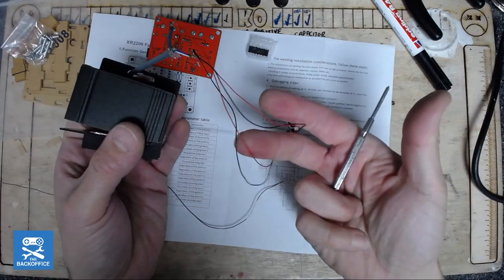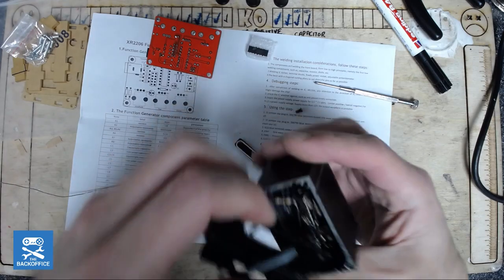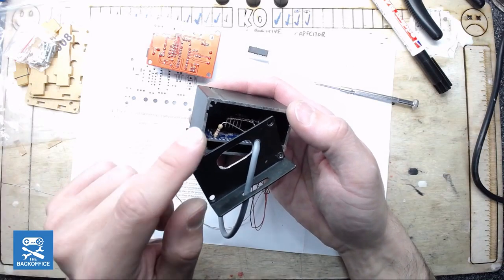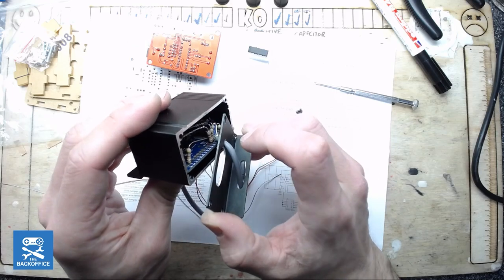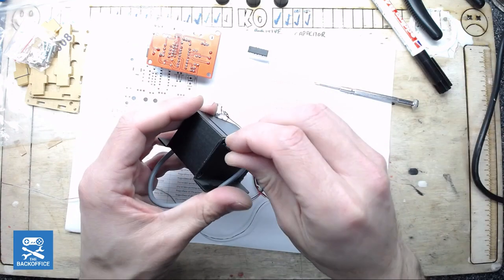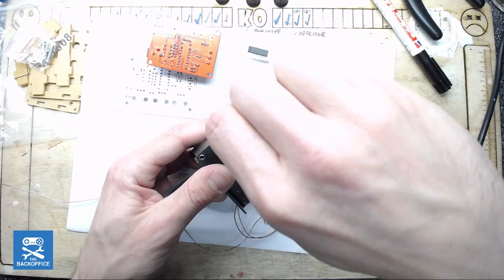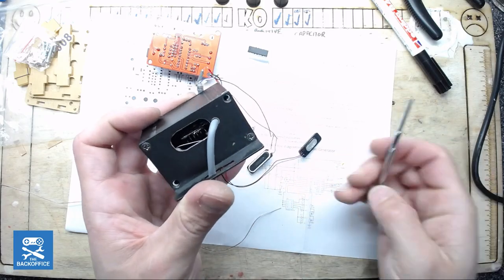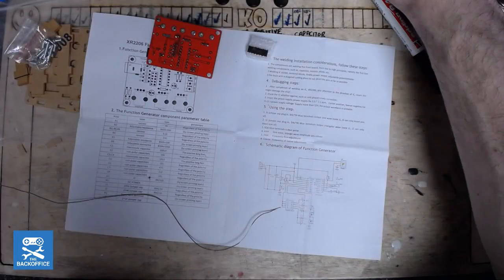And you can see here, there's a couple of speakers hanging off a wire. These originally were going to a big jack into an amp. But in here, I don't really want to break it, but have a look just about. I might try turning that light on again in case it works. It works! Hurrah! You'll see a booby board and you'll see a load of resistors. Do you see those resistors all hanging about there? So what it is, a booby board is actually generating a sort of pulse width modulated sound on a capacitive. Oh, bugger. My brain's gone. Anyway, it has a basic digital to analog converter, and you can see here there's multiple resistors on that one because I was trying to increase the resolution of the D to A, and yeah, it just plays tunes. So it is a very simple, crude synth.